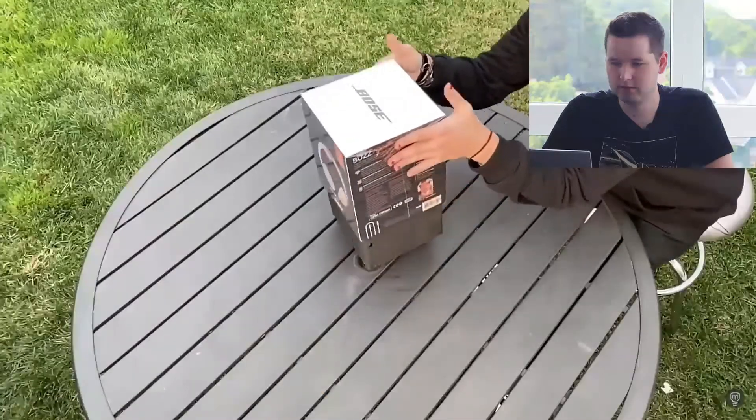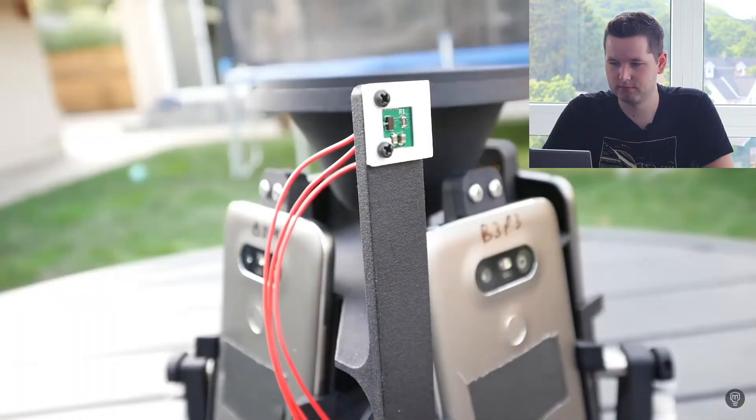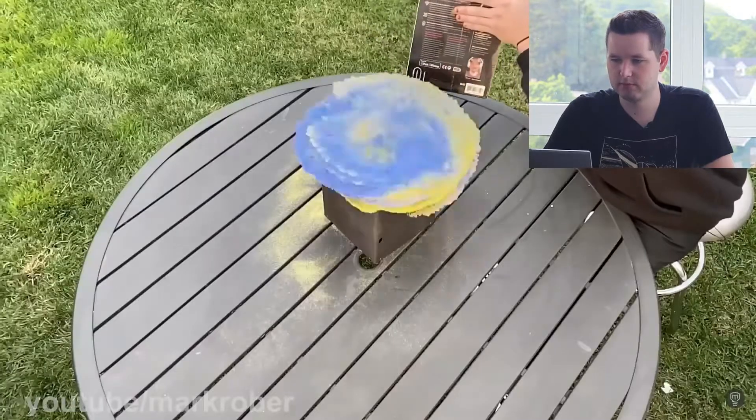The idea is the bad guy steals the package, and when they eventually remove the lid, a magnet taped inside triggers a hall effect sensor, which tells the circuit board brain it's go time. Essentially the hall effect sensor would just change the voltage level for a quick second, and then there has to be some trigger recognition system in the microprocessor that says there's been a trigger on this input/output pin — okay, let's get everything in motion. The CPU would kick off and start doing all things: throwing glitter, playing sounds, fart spray. That's the entry point for everything that needs to happen within the software.